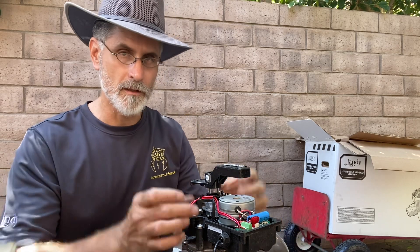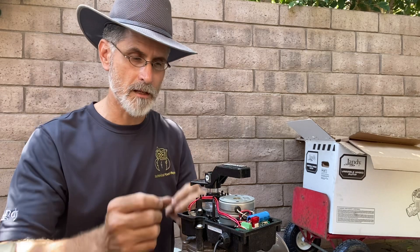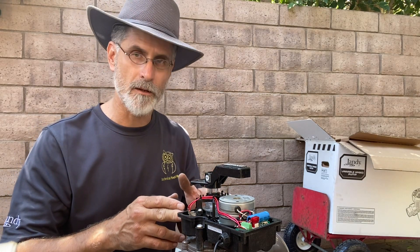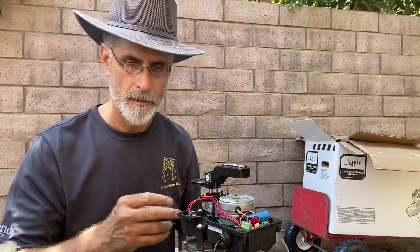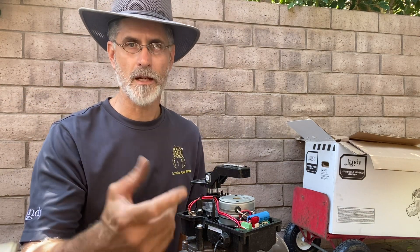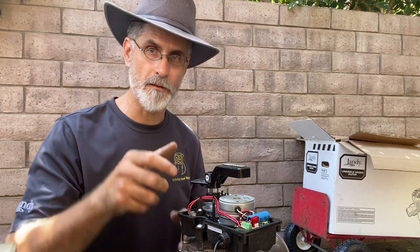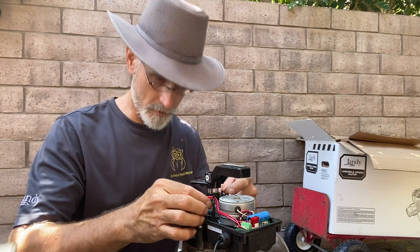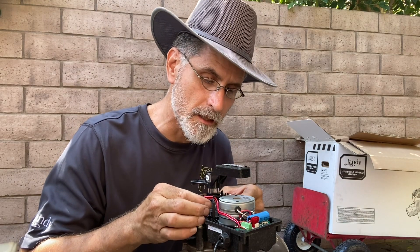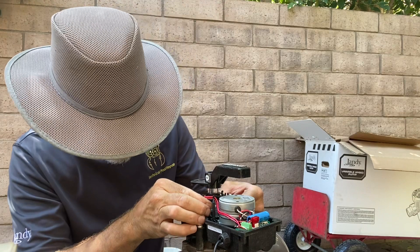The Hayward, you have to lift the cam up, turn it, and set it back down. The old style Jandy — and what is now the Intermatic — you have to loosen a lock nut before you can turn them. And I believe there's still a lock nut on the Compool and the Pentair too.